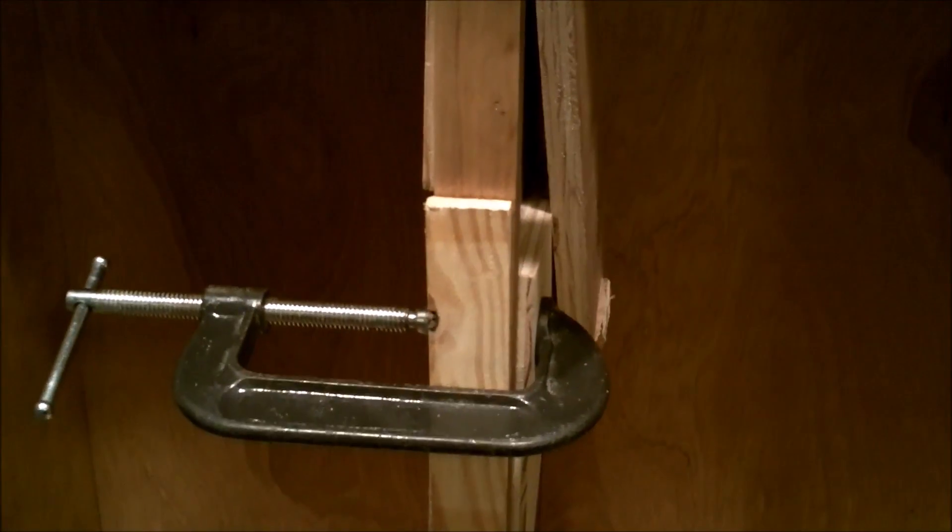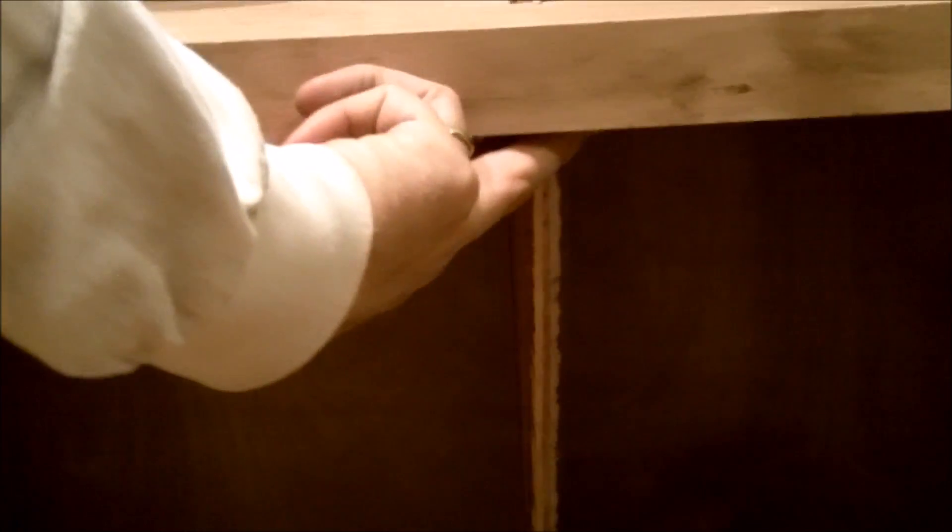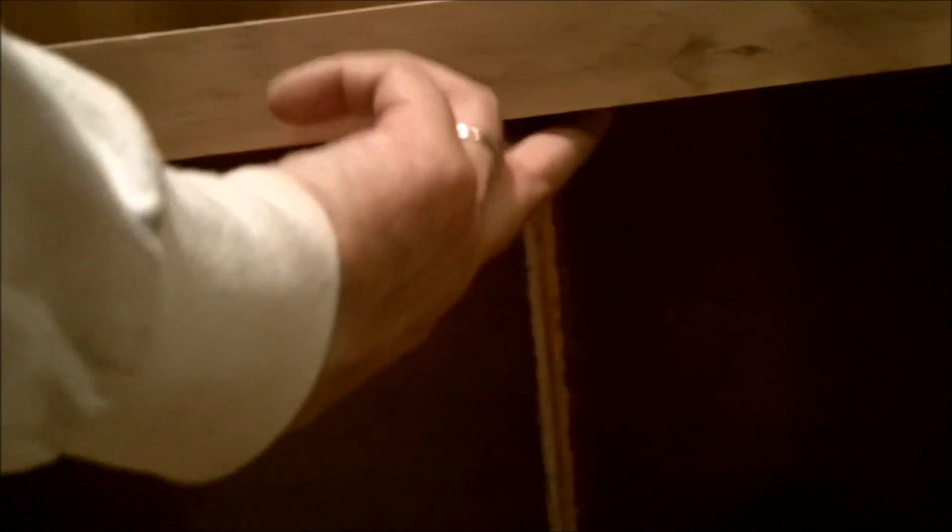Then we'll do these horizontal pieces right here. In the meantime, we can do some of this lower work — we can do that drop right there. Boom! And then finish up that baseboard. Yay — it's been more than a year! And then under here you've got yourself just a little bit of an angled piece that I'm going to need to cut. I'll probably cut it sloppy up there and then cut it pretty down there. I'll cut it flush vertical here and then cut it parallel to the floor right there — I know that angle. Then just make a bunch of those and put those in with the same method. I'll just need one clamp to push that in because it'll naturally push itself in at the floor if I push it at the top. But will it stay stuck? That's the issue — that's why we need clamps.